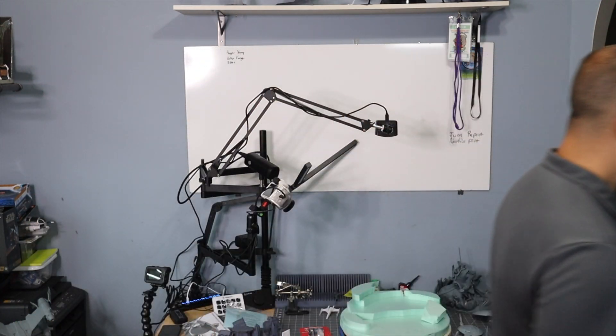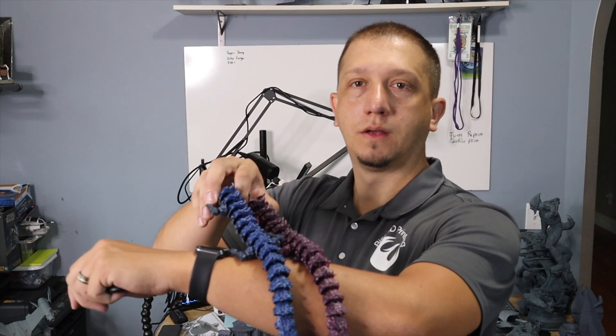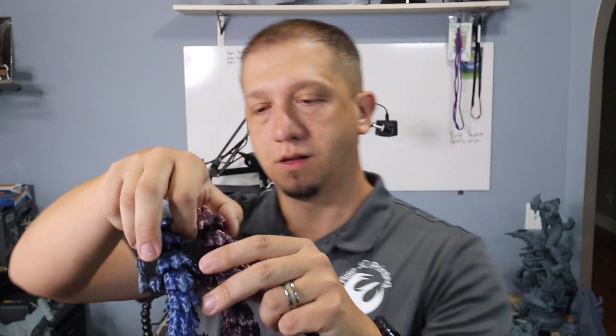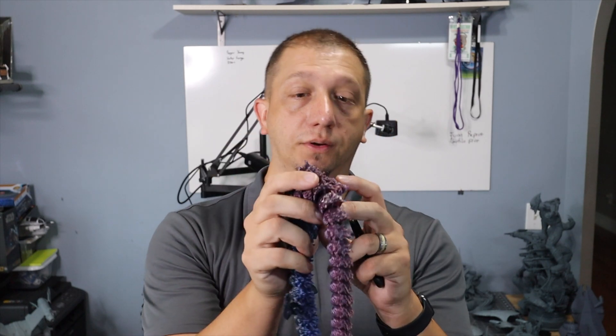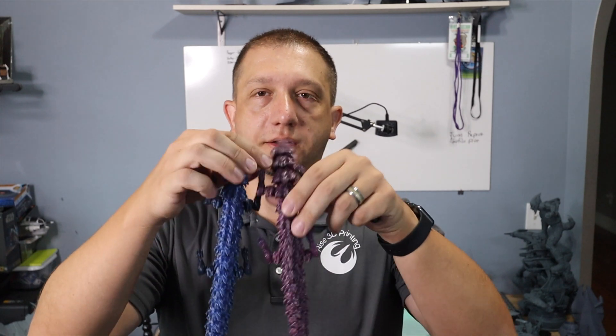What's your honest opinion of this filament? Well, I'm going to be open with you — I was pleasantly surprised. Beautiful colors. Beautiful gradient changes. And honestly, I was able to slot it in and print with not really much changes. The only thing I really did have to change — I had to up my retraction a little bit. But I was putting this PLA directly into a direct drive, so it's not surprising I had to adjust it.